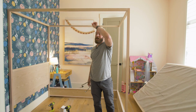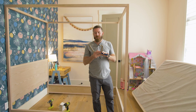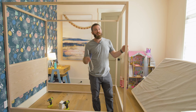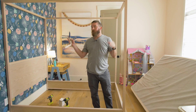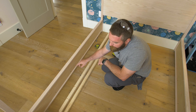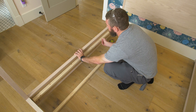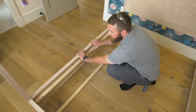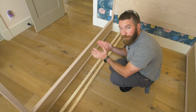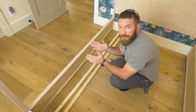The top of this canopy — this 2x2 that runs from the headboard to the footboard — actually gets installed with two and a half inch pocket screws. These clamps from Kreg that have the stud in them go through the pocket hole and hold that in place. They've been a lifesaver for getting these installed. Now I'm going to take these 2x2 furring strips and screw them into the sideboard, dropping them down about two inches from the inside, then screw them in with two inch wood screws. Then we'll come back with the 1x4 bed slats, spacing them three and a half inches apart and attaching them with one and a quarter inch wood screws, pre-drilling to avoid splitting.